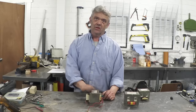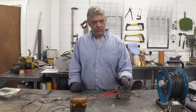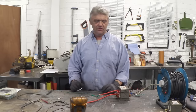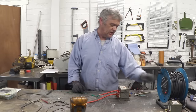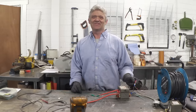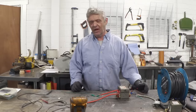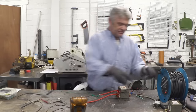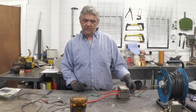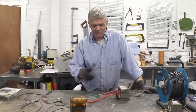We don't only get step-up transformers — we can get step-down transformers too. To demonstrate that, I've put a single turn of this red jumper cable wire through the transformer, attached it to my voltmeter, and attached the other side to the live and neutral of a plug. I've also put a momentary switch in so I have control over it. So with one turn in there, I plug it in and read that voltage — we get 0.9 of a volt.